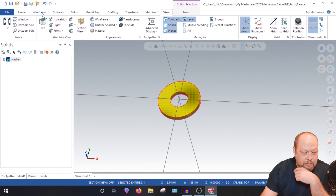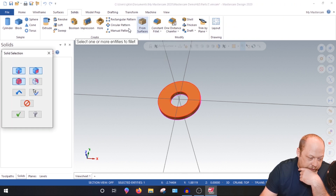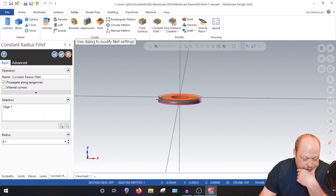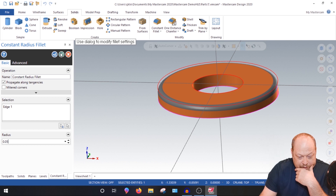This isn't entirely accurate yet. We want to go into Solids and do a Fillet, because there's a radius on the top corner. Hit the green check. It doesn't need a dramatic radius — I'll set it to 0.05. Now we've got that radius on the part.